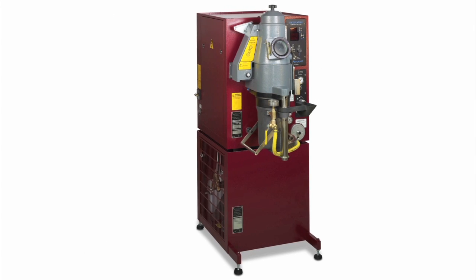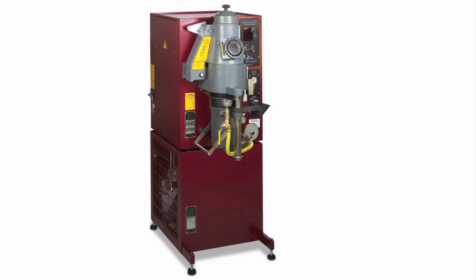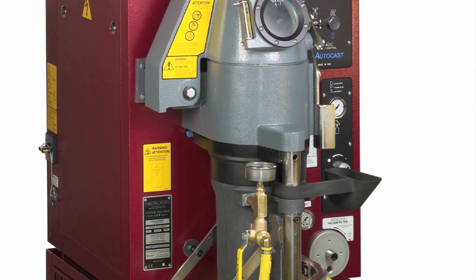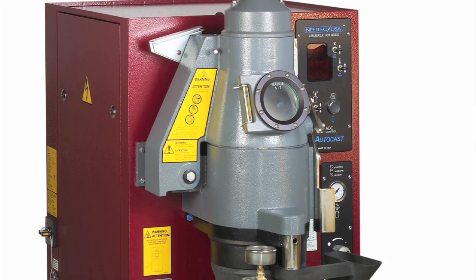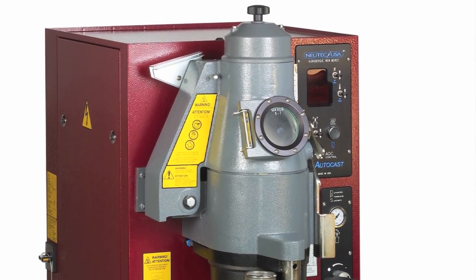To operate the JZP, a prepared flask should be in the burnout oven, ready to use. Load the machine with the necessary consumable stack. You'll see a diagram of the proper order of the consumables permanently attached to the face of the machine. Make sure that the inert gas is connected and ready to use. The casting grain for your cast should be measured and nearby, ready to use.